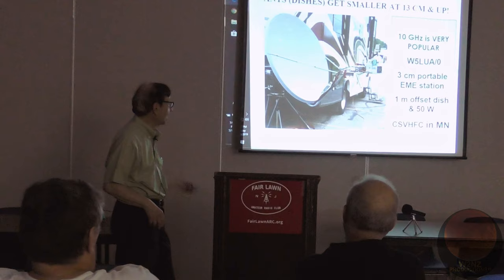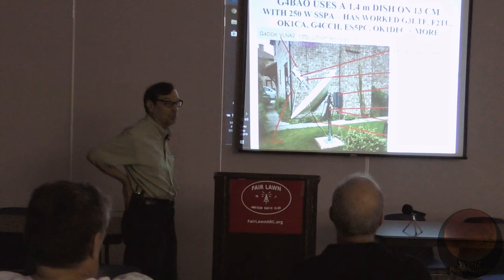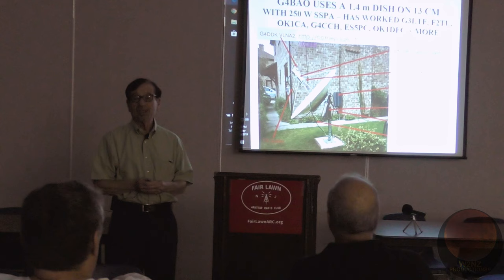No, I don't think so. I think there's a lot of surplus dishes around, so I'm pretty sure that was a commercial dish. Most of the dishes you see are commercial because they're so readily available, and as you go higher in frequency, you want to have a really good surface. The accuracy becomes important. At 1296, the accuracy really isn't that important. You can get by with some wood sticks that are bent and screening, and you don't lose very much.